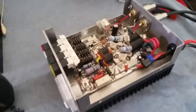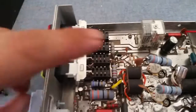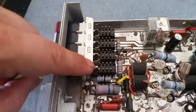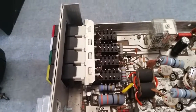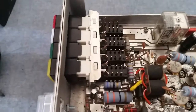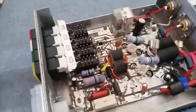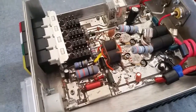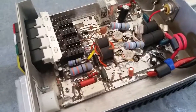Alright, my homeboy - I got you all sewn up here, brother. All I had laying around was a four-switch array arrangement - brand new. These things aren't the cheapest, and I was trying to find a used one off boards I had, but that would have taken another 30-45 minutes to remove. So I fixed your blown trace on the bottom and went ahead and insulated the bottom as well, just to be safe. These boards tend to short on the bottom as heat bows them - there are certain spots under these 250/350 boards that are good to put little insulators on.